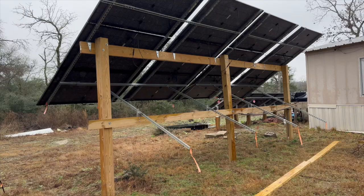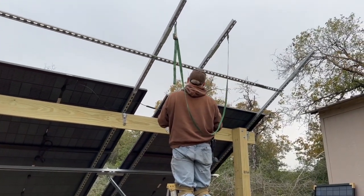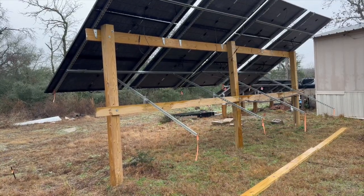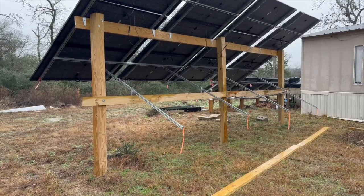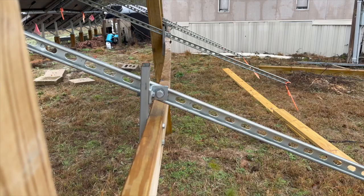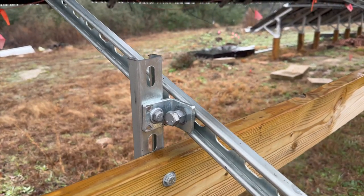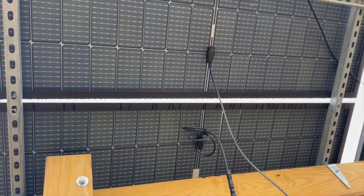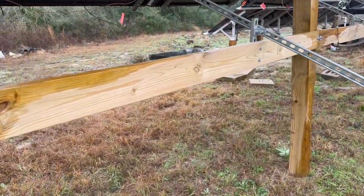You can't really see it from here, but I put two-by-eights up on the top to mount the panels on, and those pivot on hinges. On the bottom I put 12-foot two-by-six boards to add extra rigidity and support for the adjustable unistrut. Those boards have just been struggling — you can see they're bowed out. There's a lot of pressure coming on these two points per side from what is basically 175 to 200 pounds of solar panel up there.